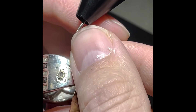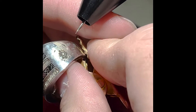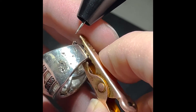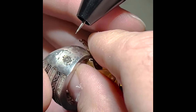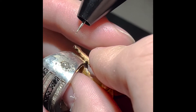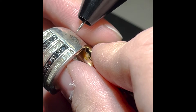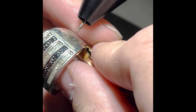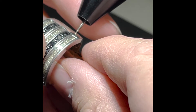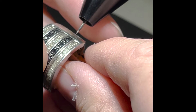I have a clean sharp electrode and I have argon gas flowing. I'm going to make a weld first in those pits where they are. The idea is to fill in the pits and smooth them out so they're not rough, making it easier to fill in later with wire. I have my settings currently at 10 watt seconds with no agitation. I'm just going to come in and touch in the center of that pit, make a few small welds around it, just smooth it out.